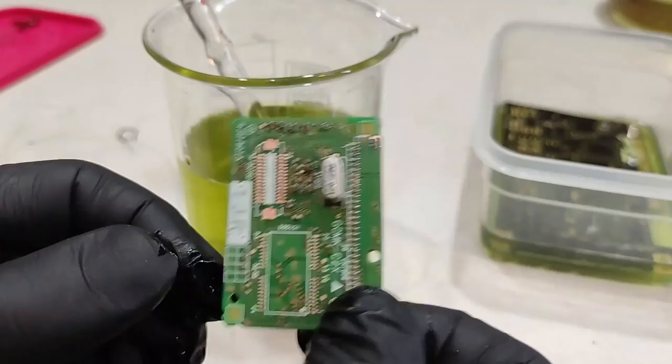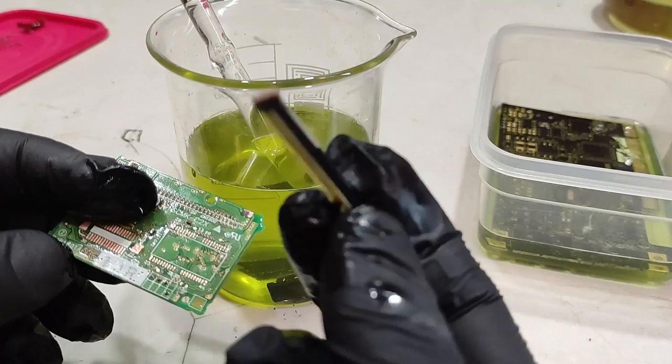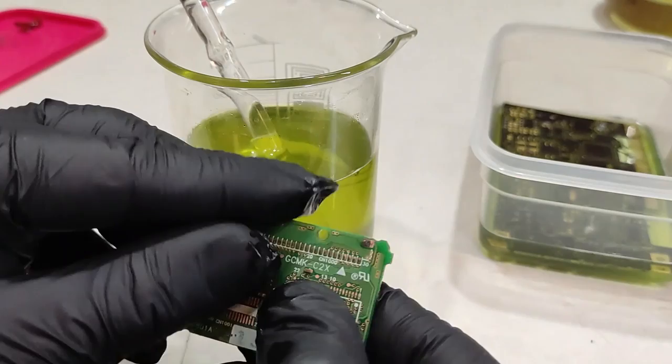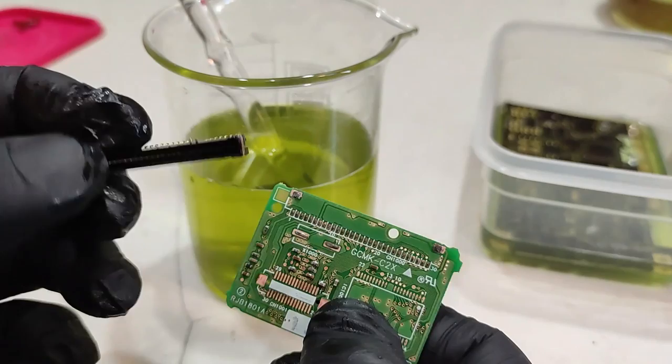You know, this solution seems to work well for all uniform soldering, including the solder part you see on the PCB, but it takes much more time to work on these connectors and IC chips, but still it works great. And as you see here, that was great. And there we go, this is for the oscillator. And as you observe, the majority of solder is gone except for this place where the connector was connected.